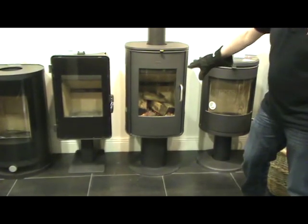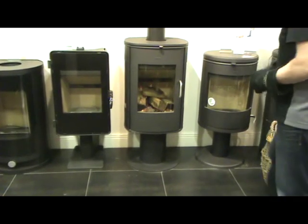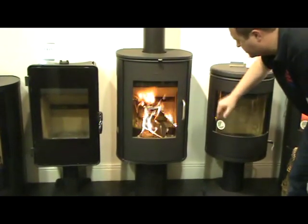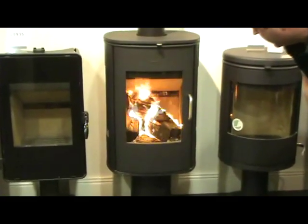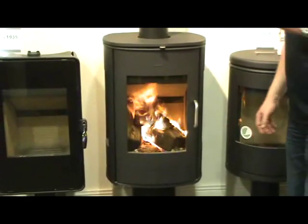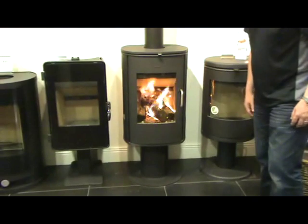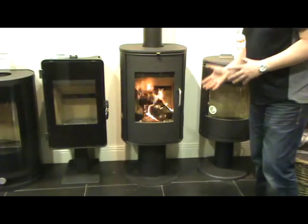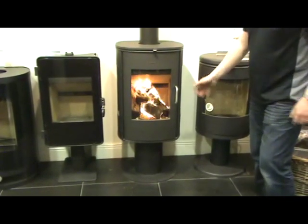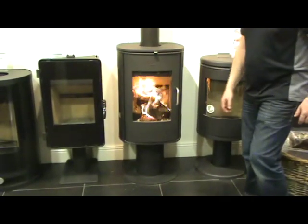We can see very quickly the first refuel starting to catch from the coals. We can see the preheated tertiary air through the back jets as the air is forced through, giving a little swirling effect. This is burning off toxins coming off the flue gases. The difference between smoke and flame is temperature. When we're at a high enough temperature there's no smoke coming off the wood fuel. If the fuel had a higher moisture content — say above about 20% — where we can't get the temperature into it, we'd see quite a lot of smoke. But the fuel we're burning is good with a moisture content of about 12%, so it takes off quickly with no real smoke visible in the fire chamber.